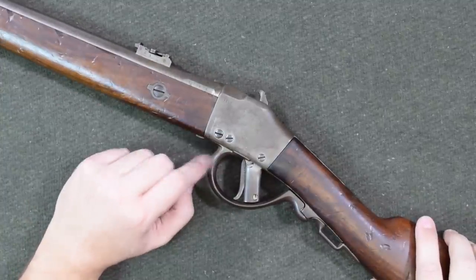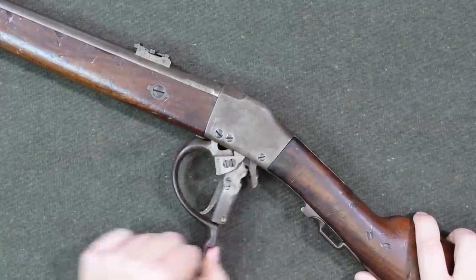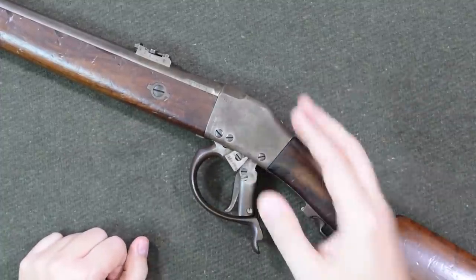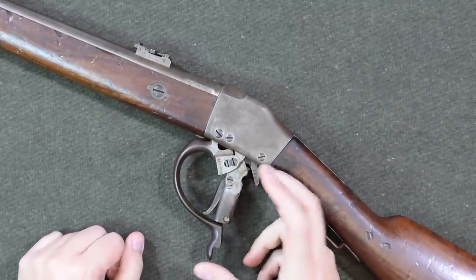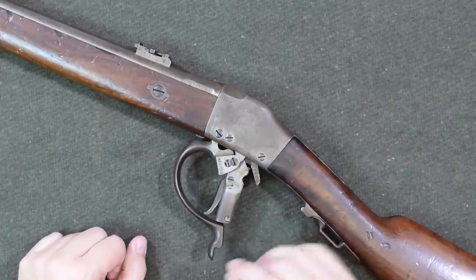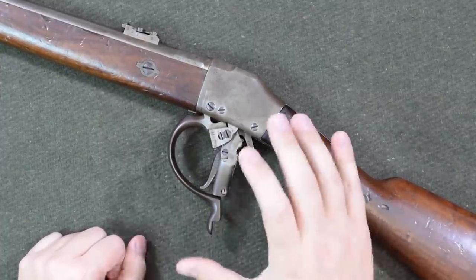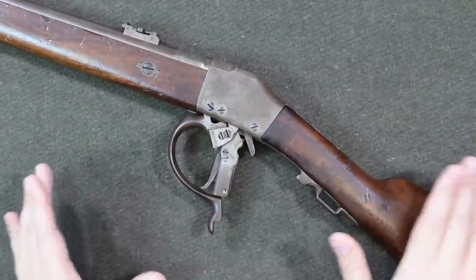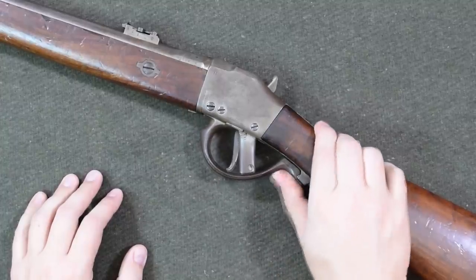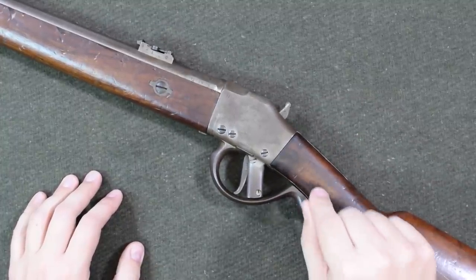The other two are doing the same thing they're doing on the rifle. One's working the hinge of this guy, and the other's holding that ejector and allowing it to clear, rotate. Overall, the internal action is basically the same, very minor changes in here, nothing worth really exploring because it's the same single V-spring. And really the heart of this gun does not change for its entire service life. It's sort of the dressings and features and reinforcements that change. But certainly cool to see a much earlier version of this gun.